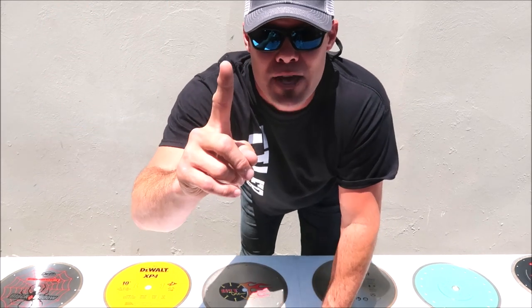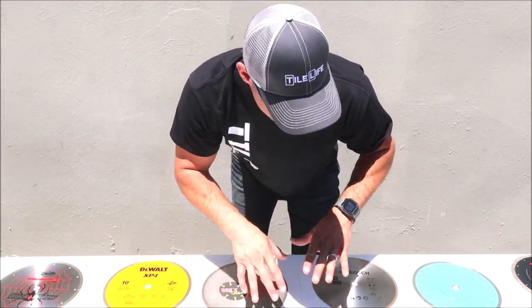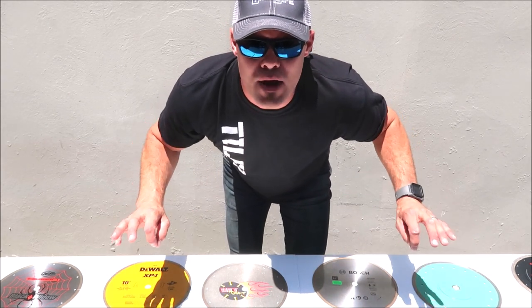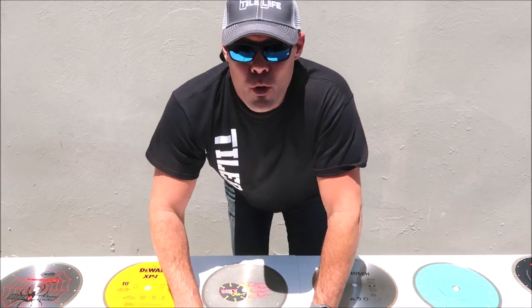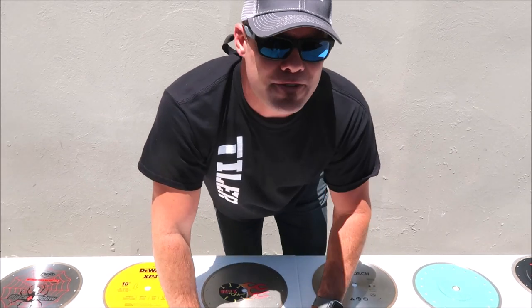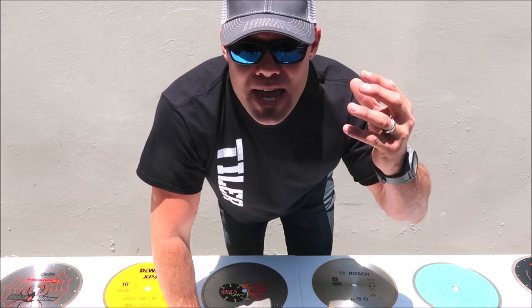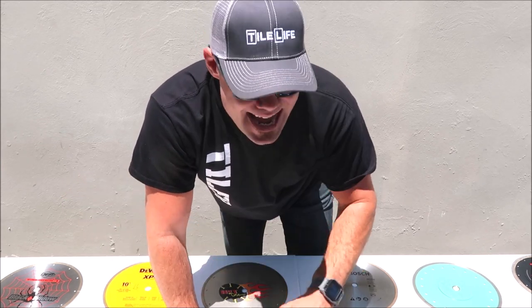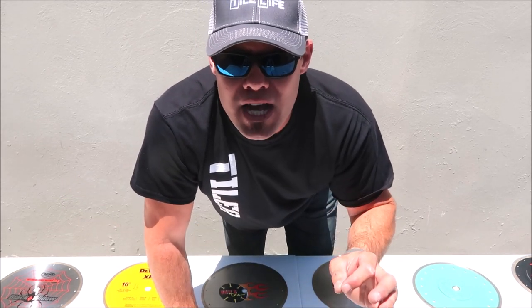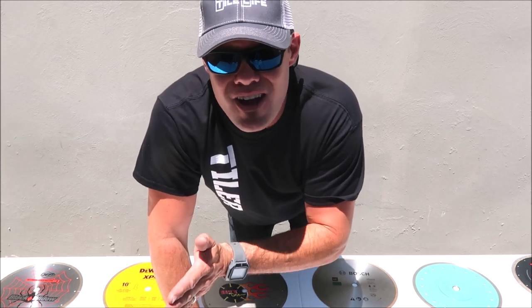Okay guys, the time has come. It's time to make some cuts. Now I've got to stress this point. All of these blades are brand new. They will cut very well out of the packaging. So I'm going to look for three things. The ease of pressure when I push the tile through the blades, the sound that it gives off, whether it's a quiet blade or a loud blade, and of course, the quality of the cut, which cuts cleaner, which will provide more chipping on the tile.